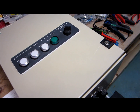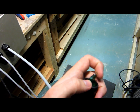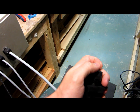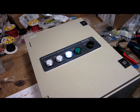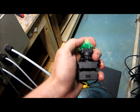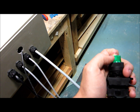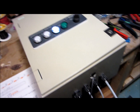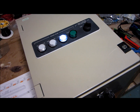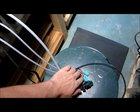I'll probably have to play with it in the field to get that synchronization just right. The selector switch will be field-mounted, probably in a junction box, just for more manual use. It is really just turning on the solenoid, so you're going to see that come on — this is just drawing off of one of the water tanks. Obviously if you used up all the water with this manual switch, you're going to find out, and you'll have to turn it off and it'll wait in line and pick up the other inputs from the water level tank sensors.